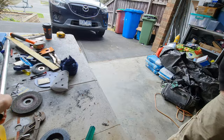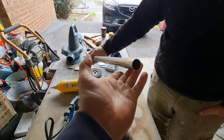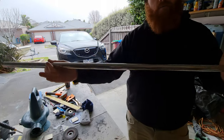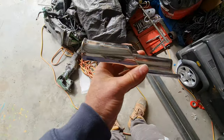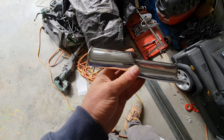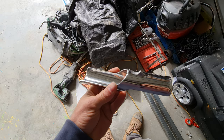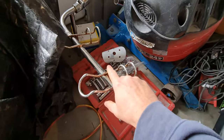Here's the tube: stainless 316 marine grade stainless steel tubing, 1.6mm thick walls, mirror finish polish — finished at about 600 to 800 grit. We are using the more expensive rod holders from Viper Marine, about $40 each, but they do look better than the old ones — just the wire ones.